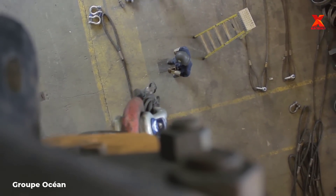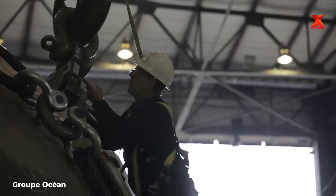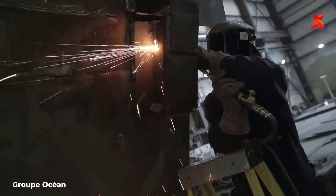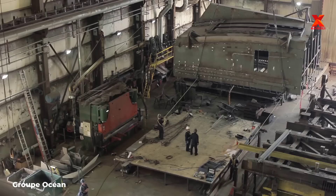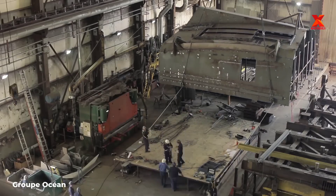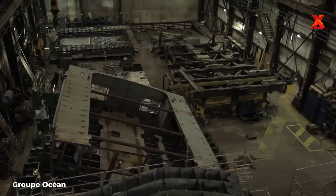This tugboat has a total length of 25 meters. According to design, it will be divided into three main blocks. These blocks will be manufactured separately from each other. The steel plates, after being cut by the laser cutter, will be transferred to the welding stage, where the welders will weld the frame first, then weld the surrounding body.